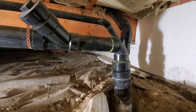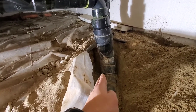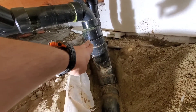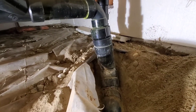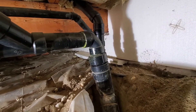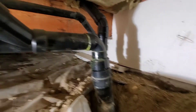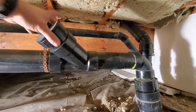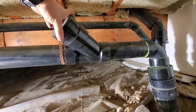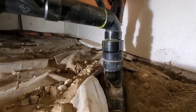This is the main for this place — four-inch pipe comes up here. I finally figured out what they've done. We have a four-inch Y; the threaded area you see right there is where the cleanout cap once was. What they did was push down into three-inch and put a three-inch cleanout — and the cleanout isn't even glued in, it's dry-fit. So we now have a three-inch cleanout for four-inch pipe, which you're not allowed to do.